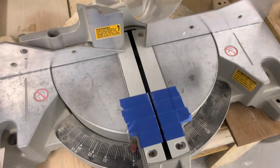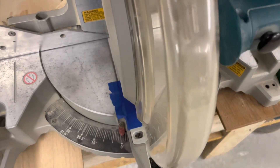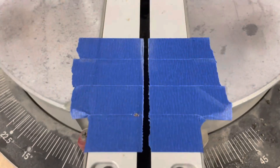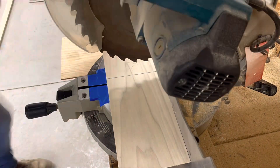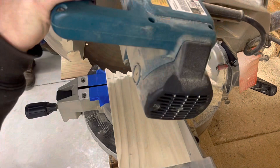Here's a little trick with blue tape on the miter saw to get the correct cut. I put tape over where the blade cuts and with the saw tilted to 45 degrees, then I cut into the tape. This will show me exactly where the saw will cut through the wood, making it easier to get the perfect cut.